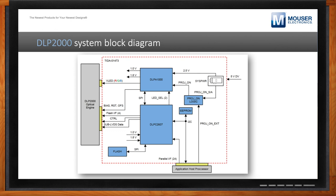If you can design these few components into your system, you can fit a DLP display into your design. While this particular EVM uses a parallel RGB888 interface to drive the display, there are space-conscious users that might prefer different mobile interfaces such as DSI, and we actually support those in some of our other chipsets. Depending on your application, you might be interested in checking those out after you've experimented a little bit with the LightCrafter Display 2000 EVM.